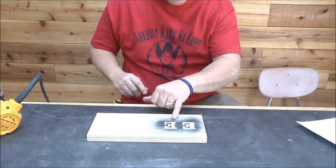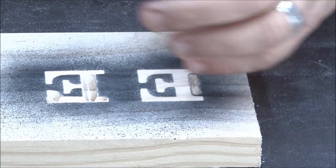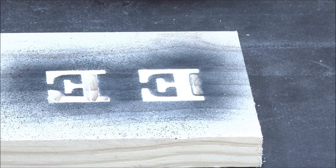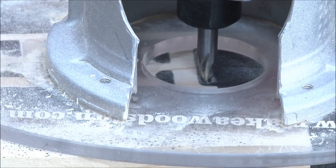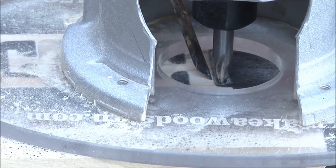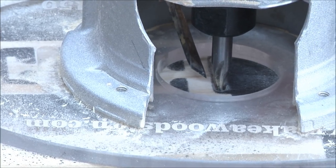Let's take two different letters. One of them is an outset letter — I've only just started carving these, but it's all I needed for this example. I normally almost always pull the router toward myself — I have better vision that way rather than pushing it away where I'd have to wonder where the backside of the bit is. So let's say I'm carving this with my profile bit in. Where I'm actually looking is right here — because as I pull that router down toward me, this is what really counts. This is my letter, so I'm actually looking at this edge.